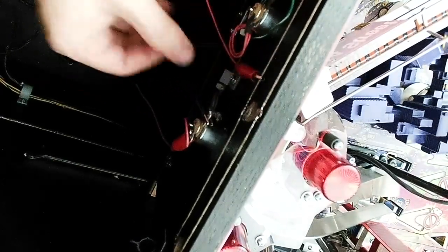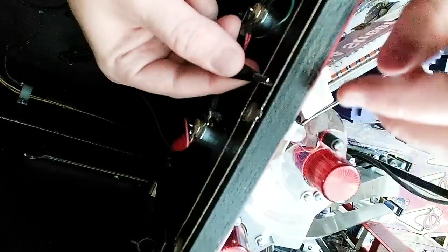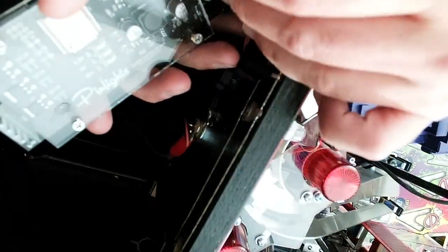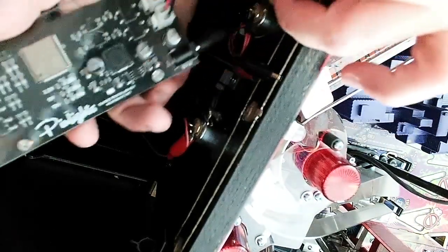Now take the GI — the same pair of alligator clips. Take the other long end of the cable and plug them in together, then connect the alligator clip end to the GI string. Polarity doesn't matter. The backboard GI connections are great because they use long braids that are easy to attach to and easily accessible for service. Then take the white Molex ends and plug them into the GI connection on the board — make sure you're not over by one pin. We've now got both power, flasher, and GI connected.